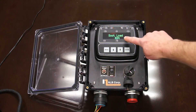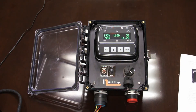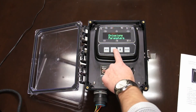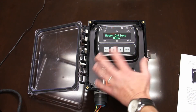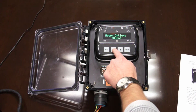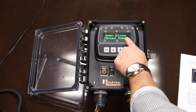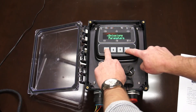At this point you'll see 82% and this light is on. In a perfect world, the operator should perform the regen. To do that, the operator needs to push the menu button and push enter. You'll get an emission parameters message. Go up arrow once — regen option auto. That's what this defaults to any time the engine is turned off and back on. What we want to do now is push enter, go up. This is inhibit regen — we do not want inhibit regen. We want request regen. Once we have that, push enter again. You'll see the parentheses go away. Then push menu, enter.